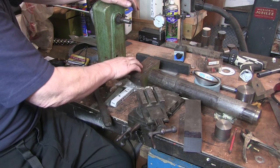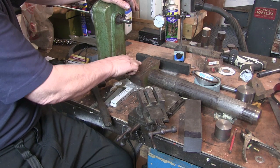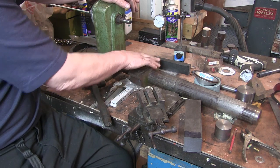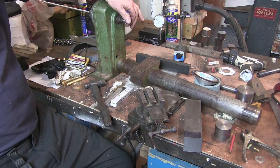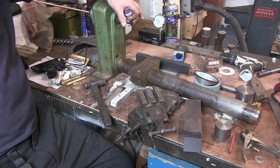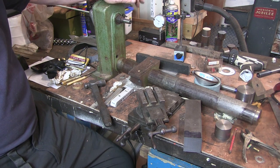That's a bit of a weighty bugger. I can take a little bit off of here — I'm going to have to take a bit off because where it's been sitting about it's got a bit rusty, so I'll put that in the mill and skim it anyway. But the first thing to do is get a sleeve made for this, and then see how accurate I can do that and see how it transfers back to here when I've got a wheel on it.